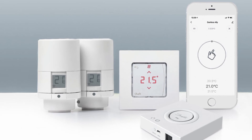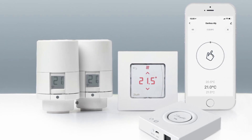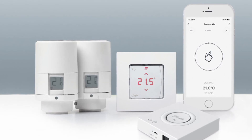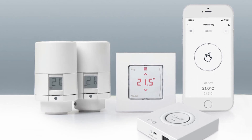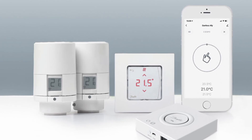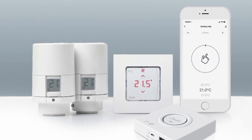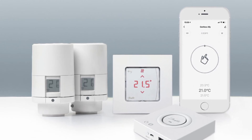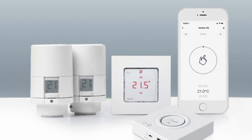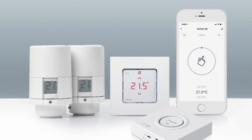For now I'm happy with these new thermostats. Just being able to drop the heat during the night should save me some money. They should also be more accurate than the old ones — the old ones were plus or minus one degree, whereas these should be within half a degree or less. That improved accuracy means less overshoot, which saves a bit of money even if you kept the same target temperature all day.